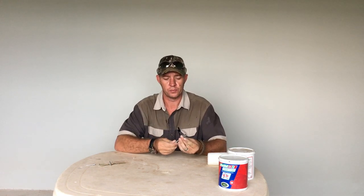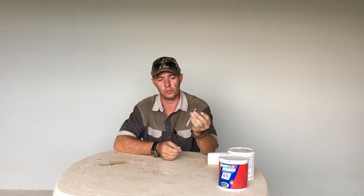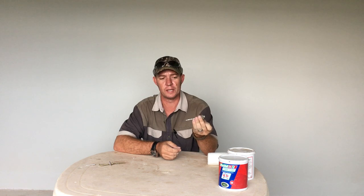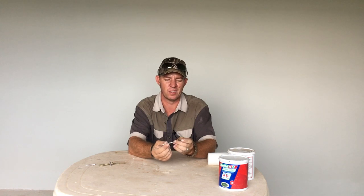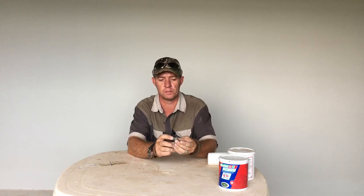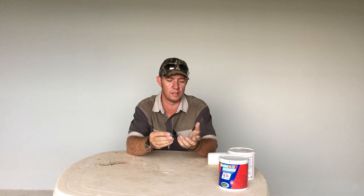After we've got the roof ready to be cleaned, we go around and check for damaged screws or damaged boards, corrugated iron plates and so forth. This is the old type of normal roof screws or roof nails that we get in South Africa. It's got a helical type of thread on it with a plastic washer and a zinc top. It often happens that they work their way out with vibration from the wind. Sometimes they rust off, sometimes the wood expands because of water running there.